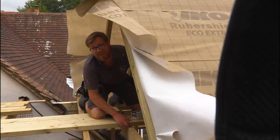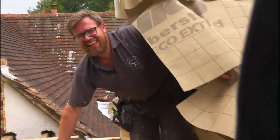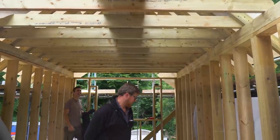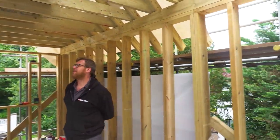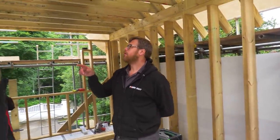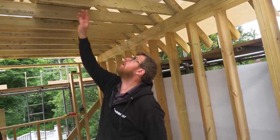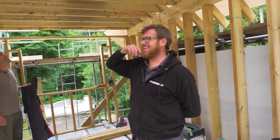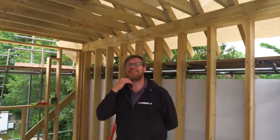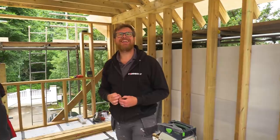Where's James? Hello mate, that flapped out just in time didn't it? I got here too late, you've already built the place. This morning you've done this James - when I left you on Friday we just had the studs up. We've got all the ceiling joists through and got the commons up, pitched up to the plate, and this morning Ian did a scarf joint. You love doing the scarfing now. I'll see if I can get a close-up of that - here's one I did later.